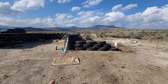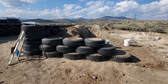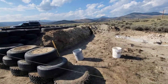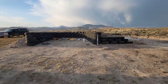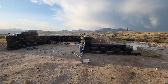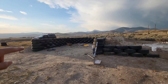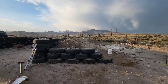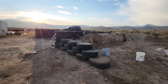I've got the whole third course — those three tires — done. That's 11 tires today, so it's a pretty good start on the wing walls. You can see the trench I'm starting to make — that'll be for the blue board and thermal wrap. This is how it'll sit until I'm back in October for the whole month. I'm going to try and finish the wing walls, get the rest of the tires up, and put in the thermal wrap, vapor barrier, and the water cistern. Hopefully all the tire work will be done in October.